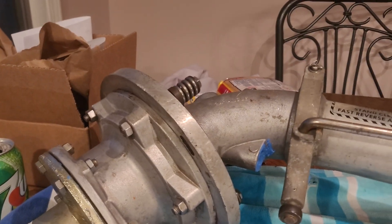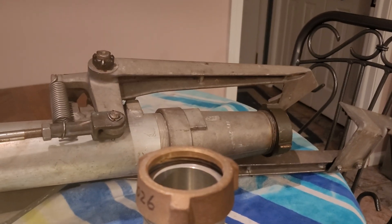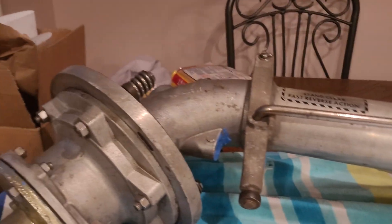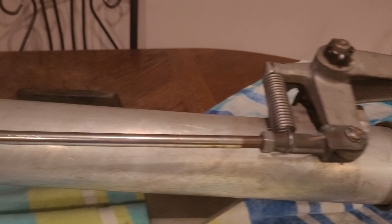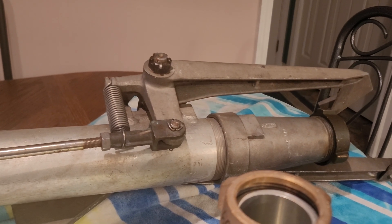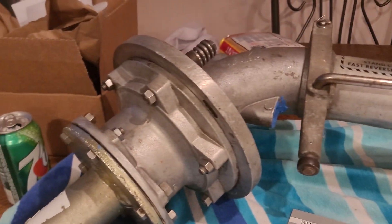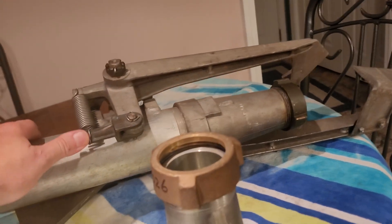I've got many videos of these on my channel, including one of this one running off my setup. It works but it's not like what you'd normally see out in the field, because those are being run by big ag irrigation pumps — electric or PTO-run off an engine. I just have two small seven-and-a-half horsepower transfer pumps in series. I had to get this smaller nozzle because it would not run with the original nozzle. If I'm going to run it with the original nozzle I need a big ag irrigation pump and a cart, because this would flip over as soon as I turned it on.